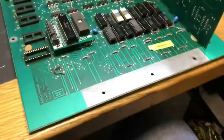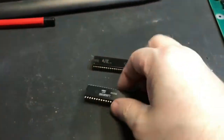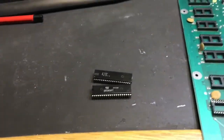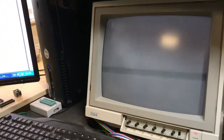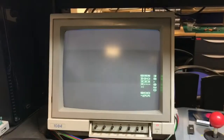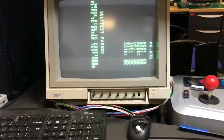Let's try the CPU. And what do you know — the CPU did it. Okay, so looks like I've potentially got two dead 8080 chips. I've borrowed one off a board set I've been working on just for tests. When I put it in, something weird happened where it didn't completely initialise — I'm going to see if I can get it to happen again. It goes through its pattern and it came up with a black screen and did some beeping, but I suspect that was me pressing on the board incorrectly or one of the RAMs wasn't completely socketed. All the other tests pass okay by the look of it.